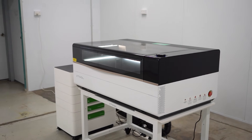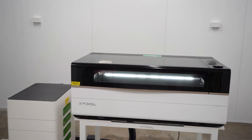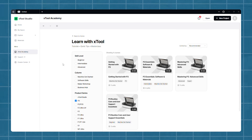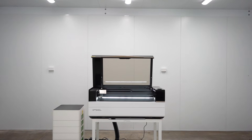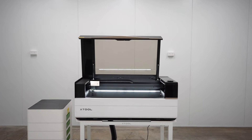Like most things in life, making a laser cutter is an optimization problem, and I feel like the P3 gets it pretty right. Instead of a fancy metal RF laser tube, it uses a water-cooled glass tube — an 80 watt metal tube would make the machine cost a fortune. You could replace the stepper motors with high-end industrial servos and get triple or quadruple the cutting speeds, but again, that would cost a lot of money. Instead, they invested in really nice, easy-to-use software. The P3 strikes a nice balance — beginner friendly, a premium experience, yet still capable of serious work. That's a really strong selling point for the high end of non-industrial use.